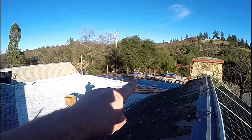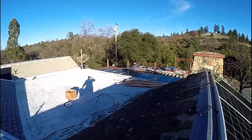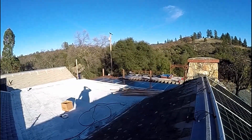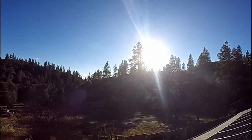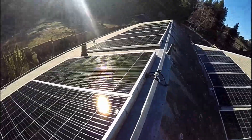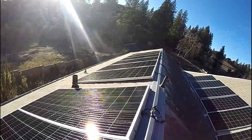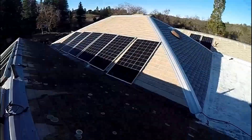The old panels you see there were attached to our pergola and were flat-mounted, which is not a very good angle to capture sun — and mainly east-facing, so they only collected early morning sun, not the overhead south sun. As you can see, the sun is casting on the south side of the house late in the afternoon. This new position is way more optimal, and the angle of roughly 30 degrees is pretty good for year-round collection, averaging well for both summer and winter.